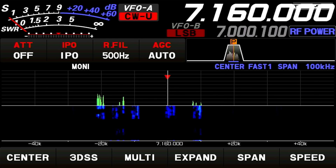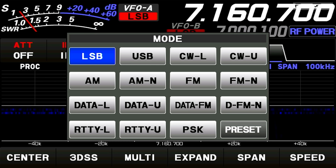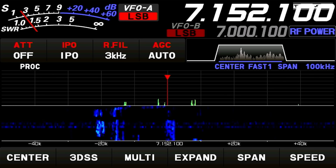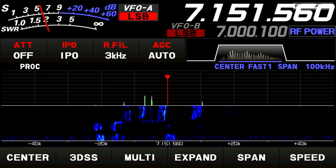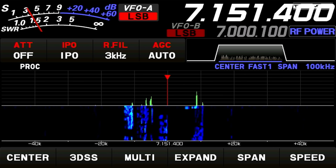I also tested on 50 megahertz — the 6-meter band — but failed to record it. It did work rather well and was able to give a good tune, though I didn't make any contacts. Having a good tune or match doesn't mean your antenna is going to work amazingly — you could load up a wet piece of string to provide a 50-ohm match to the radio, but that still isn't going to work well.